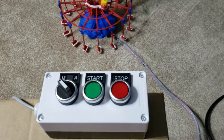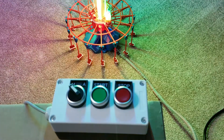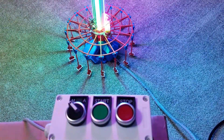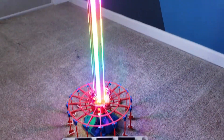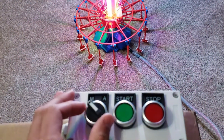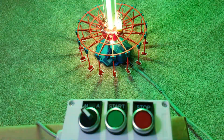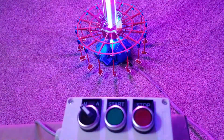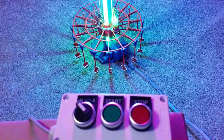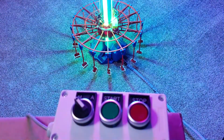Now I'm going to go over the operations of the ride. First I'm going to turn it on. Now that we have power, we're almost ready to start but the ride has no idea where it's at — it doesn't know if it's halfway up the tower, at the top, or at the bottom. So what we need to do is home the carousel. We're going to do that by going to maintenance mode and hitting ride start. What this does is raise the carousel about an inch off the ground, then lower it until it sees the limit switch — which it just clicked in. Now that we're on that limit switch, in the program I tell the stepper motor that this is your zero position, so it knows this is my home position and it should go back here at the end of the cycle.